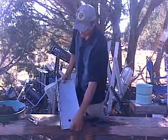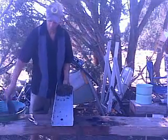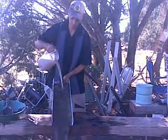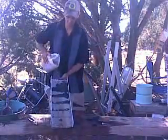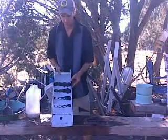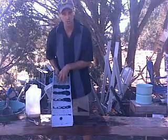I'm going to show you how this works. I've got a bucket set up below and a scoop with some gold-bearing material. I'll set that at the beginning, then take some water and show you what it looks like when water flows down the riffleless sluice box. You'll notice that these giant riffles of black sand appear. This can be a pre-sluice system to your normal dredge or sluice box or any other system you're running gold-bearing sands through.